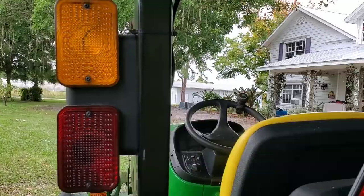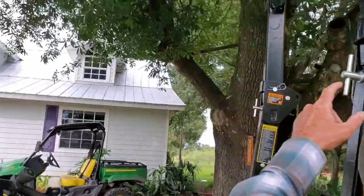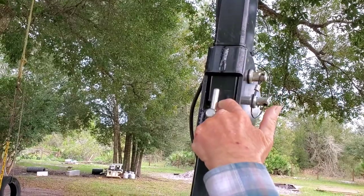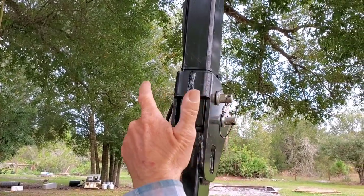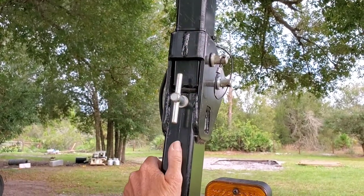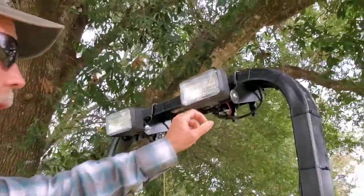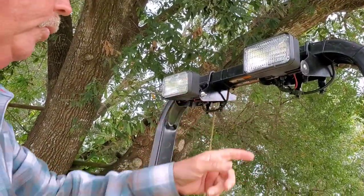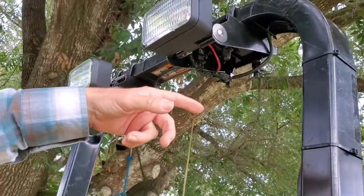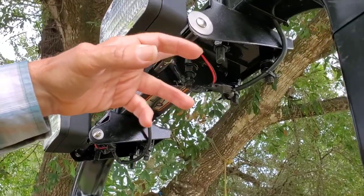What I would have liked to do was run the wire down inside the roll bar, but when you get down to the roll bar it's welded shut at the bottom — so it was impossible. I had to run it on the outside and just tie-strap it. These lights come with a small bracket about one inch wide with one bolt, and I did not want to drill holes into the roll bar or weaken it. That's why I went out and bought these aftermarket brackets — and I didn't want the lights to get knocked off either.